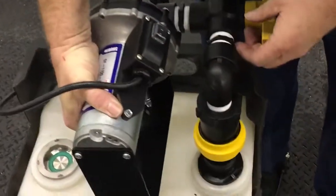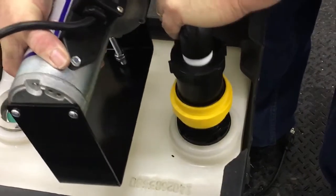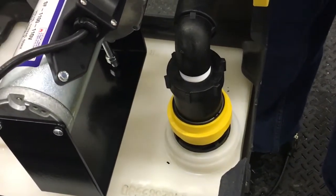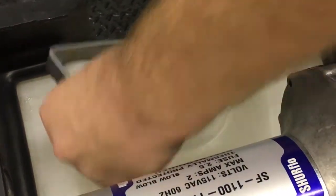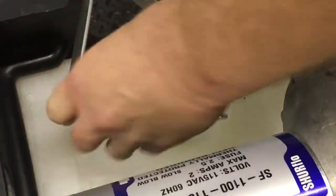First, connect the dry brake onto the male half of the drum. You can skip that step if a mechanical mixer is already in place. Next, connect the stainless micromatic valve into the female half on the drum. Lock the handle down to engage.